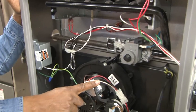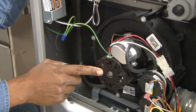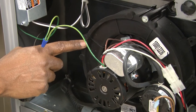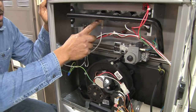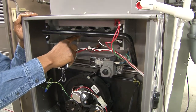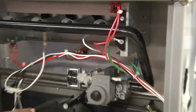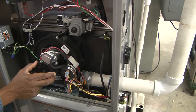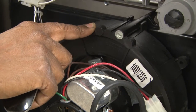Another component, because of the high efficiency of the furnace, is the induced draft motor. This induced draft motor is designed to force air into the heat exchanger to remove the flue gases. As it's pulling the flame in, it takes primary air, pulls it inside of the combustion chamber, allows a draft to go through the heat exchanger, gets collected inside of the blower, and exhausts it outdoors through this PVC pipe. This is the motor, and inside of this blower housing is a blower wheel, which causes the movement of flue gases.